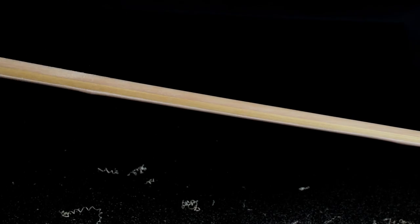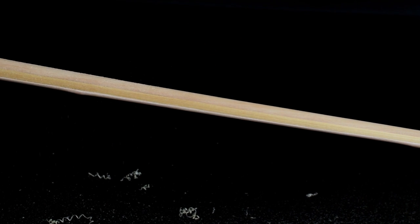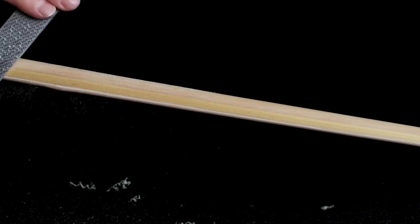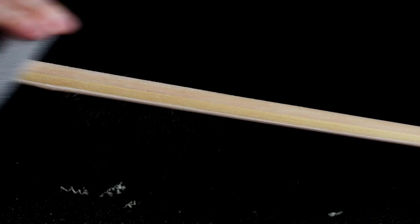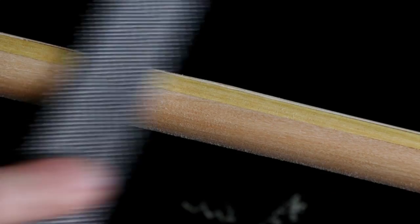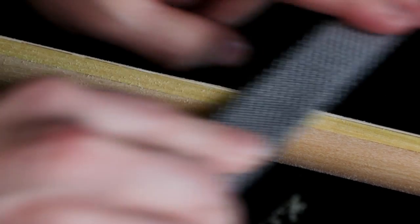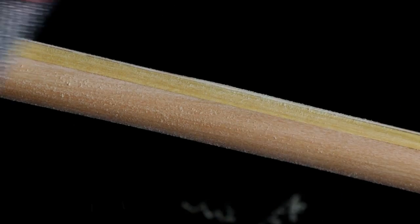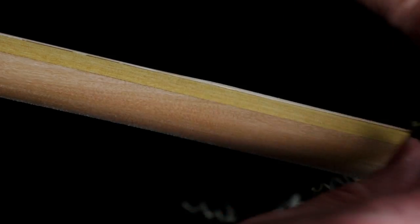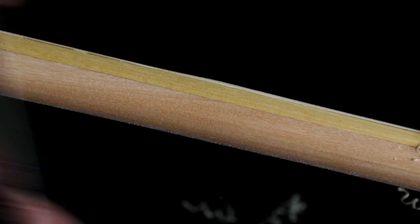After checking the tiller, I can move on to finishing the bow, starting with a smooth cut file to get rid of any larger marks or ridges that might have been caused by other tools. I use long strokes to avoid creating dips and use minimal pressure, being mindful of that D-shape curve of the limbs. Then I can move on to using the scraper. Used correctly and carefully, you can remove any heavy to medium marks that are left.